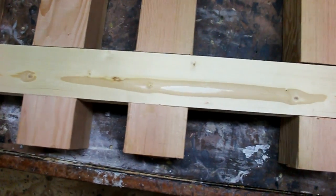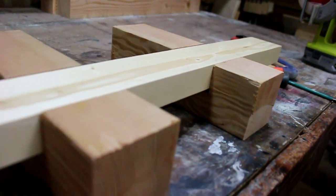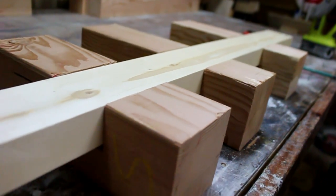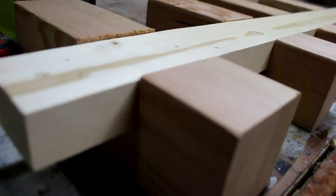If you make your first couple of cuts and you don't want to just hog out all that wood and take all that time and make all that dust to do it, you can use the method I just showed you with the circular saw, but you can do it on the table saw or your chop saw, however you want to do it. Cut 3 to 4 lines and then use a hammer and a chisel or a screwdriver or just beat it with a hammer and break it along the grain. It'll all come out, and when it meets up in the end, it's gonna be hidden anyway.